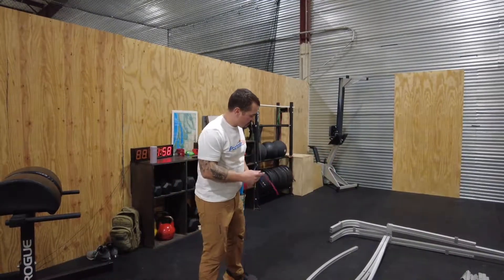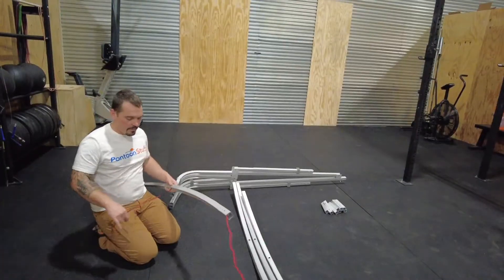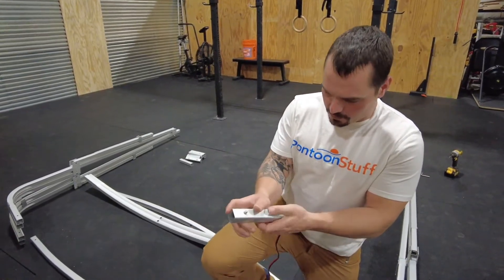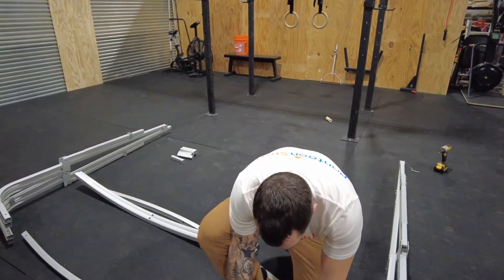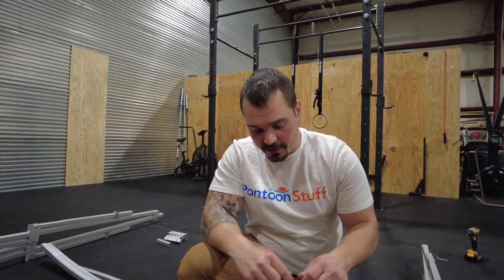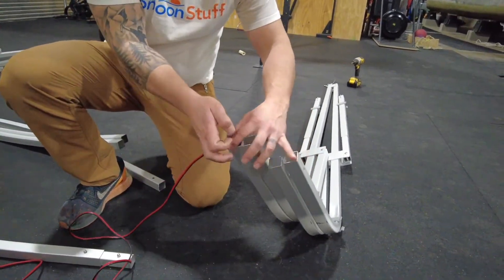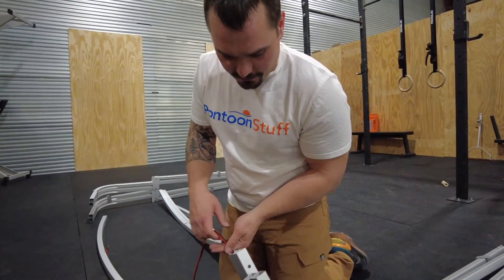I know I'm going on the starboard side next to the console for my wiring. With that wiring included, I'm going to start by taking my farthest-back bow and running my wire right through that before I do anything else. I'll tie a little knot on the very end of it, pull the rest of the slack through, and feed my wire right through before installing this. Then we're going to use the vacuum trick to pull this wire through the frame all the way out the bottom. I'll tape a little piece of plastic on the wire end so I can vacuum it through, feed it in as far as I can, then fire up the vacuum, seal it off, and let it pull the rest of the way.